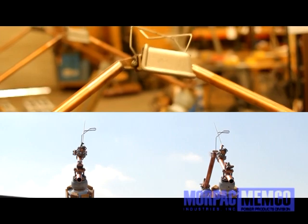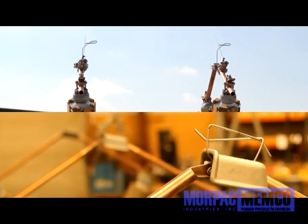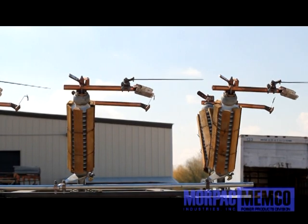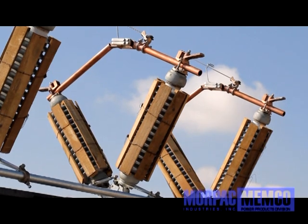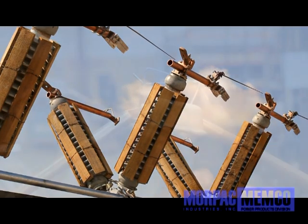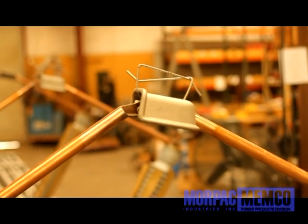In either case, adjustments can be made after installation by simply bending the arc horns to fine-tune the contact pressure as mentioned prior. The ultimate goal is to make the phases open and close, maintaining an uninterrupted connection of the whips and or arc horns after the switch contact points disconnect until the intended disengagement of the whips and or arc horns. As stated, the settings, adjustments, and installation of either the whips or the arc horns are typically done at the factory and should need no adjustments. In rare cases where the whips or arc horns are not pre-mounted, they will be attached to each phase along with proper markings for correct installation, as was done and tested at the factory.